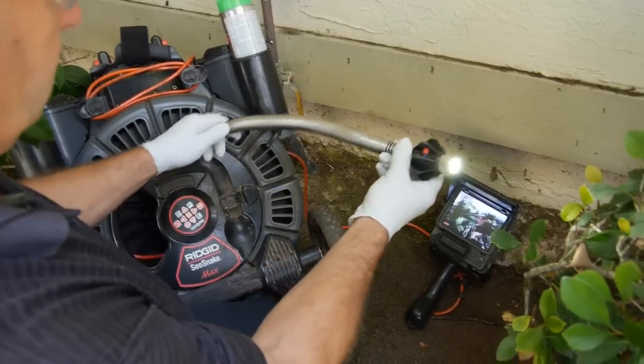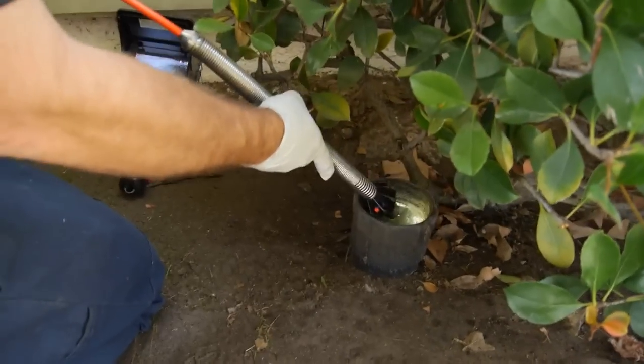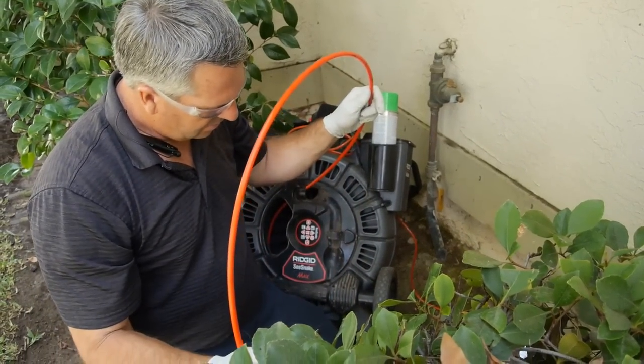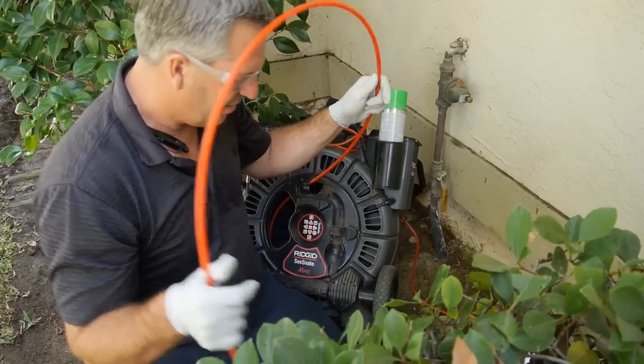I really think there are three benefits. One, this D2B spring works better than the standard spring. I don't think there's going to be any doubt of that. It will work very well. I see no drawbacks to it. Two, the push rod. The jacket of it is much slicker, and I think will outlast the other older jackets.